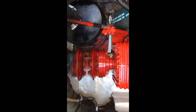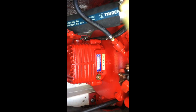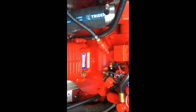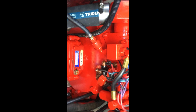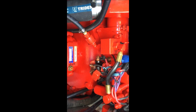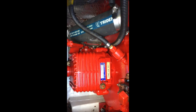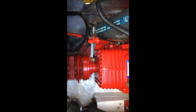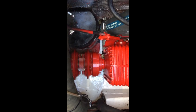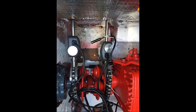During the course of using this tool, I determined I had run out of space at the front of the engine — I could not get the engine low enough. So the spacer had to be removed from the front of the engine. In order to do that, we had to take the front engine mounts back off, unscrew the spacers from the motor mounts, and reinstall the mounts back on the front of the engine.